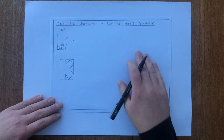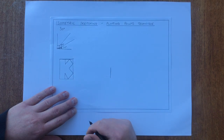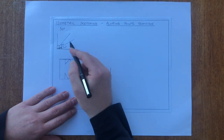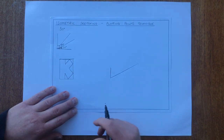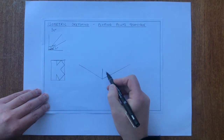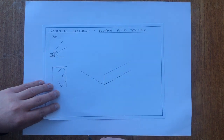We then want to draw an isometric box to the correct proportion. To draw an isometric box — as we looked at in the first sketching video — we start by drawing a vertical line, then draw V shapes at the bottom and top of the box. The diagonal of the V wants to be at 30 degrees, so I'm going to sweep my hand across and draw a line out to the right, then do the exact same thing on the other side. The V at the top wants to be exactly the same shape, with these lines parallel to the ones at the bottom.